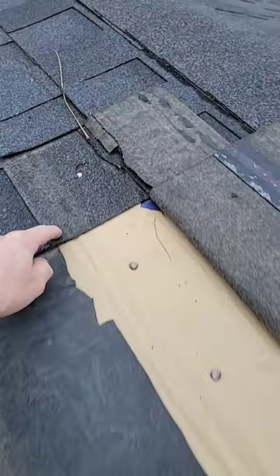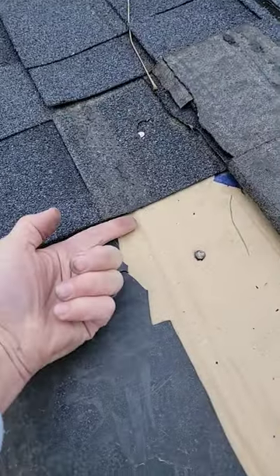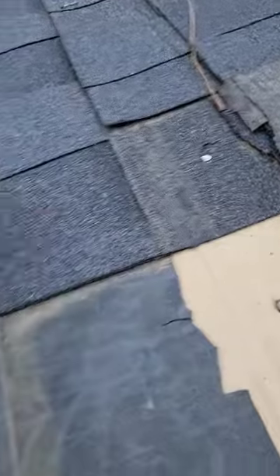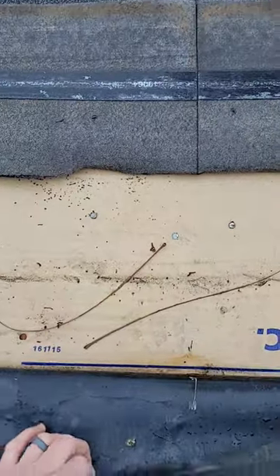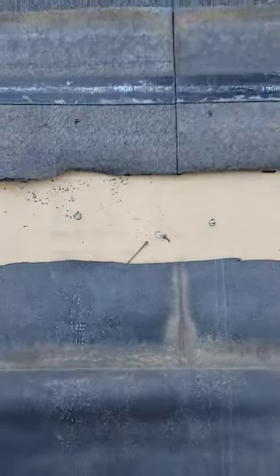The wind damage area: nails are too far up and the rubber doesn't pass far enough. It's a top seal shingle with nothing sticking down — they're all blowing free all the way across. The last defense is the paper, which runs under the rubber, so nothing is being caught. It's all leaking.